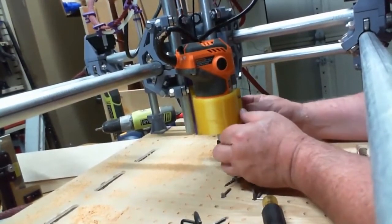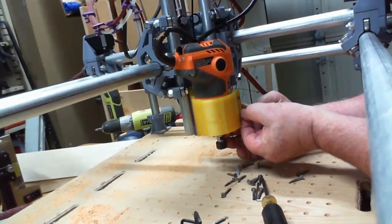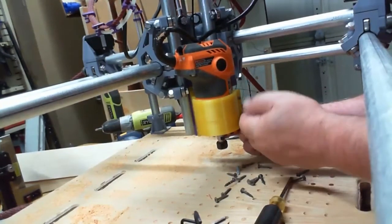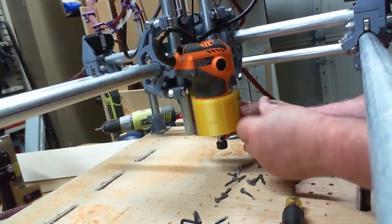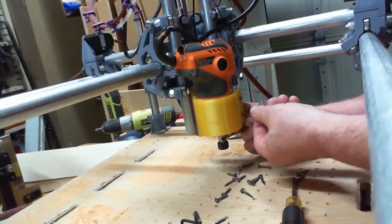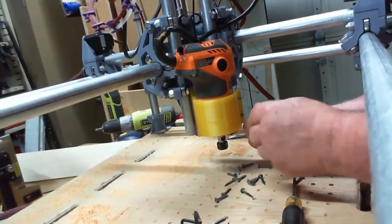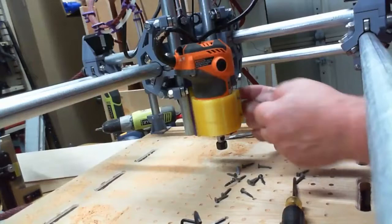and it'll be a different design, because the one thing about this is all these open rails. You know, sawdust is not too bad, but if you have to have coolant and other stuff to cut metal, it really needs to be well designed to handle that. Your stepper motors should all have covers, be protected. Electronics should be protected. You should have chip control in place so you can get the chips off the work, recollect and recycle the coolant.